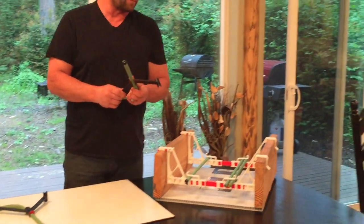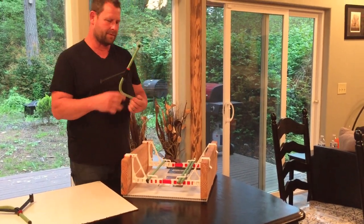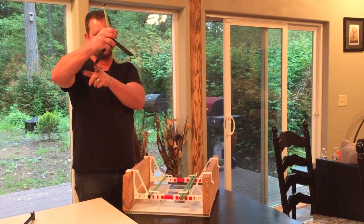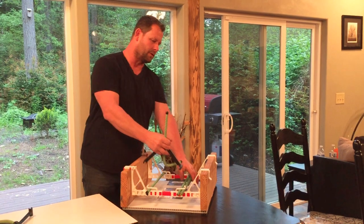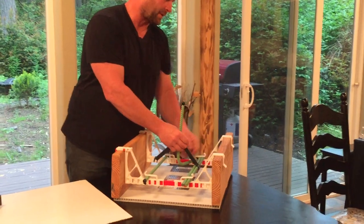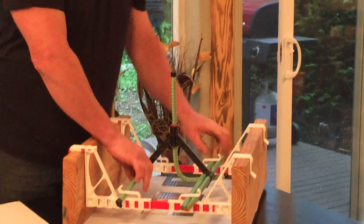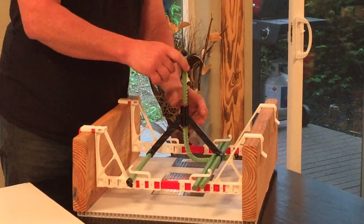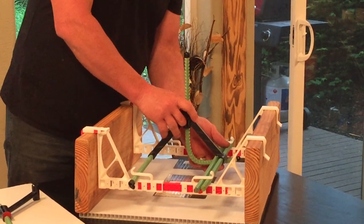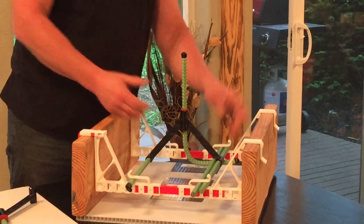Now, when it comes time to install the hooks, lay them out accordingly when it is time to snap them in. Then you have a sideways snap and a straight up and down snap. Always pull the sideways snap towards you, snapping it into place, opposite side down, setting your rebar track. If you need to tighten up the hook for contact, just gently wiggle it back and forth and pull it upwards when it is tight.